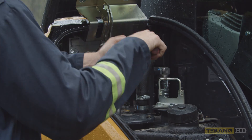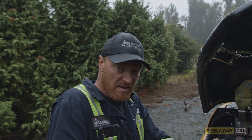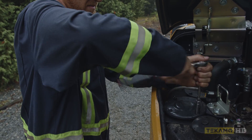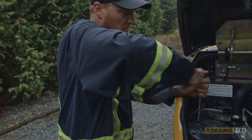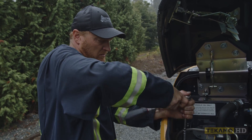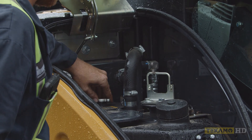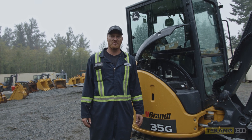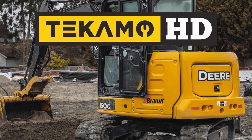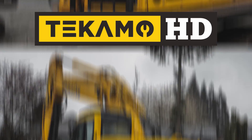When you're doing up these four bolts, I like to do the second one across from the first one — it brings the cap down evenly and makes sure you have a good seal. Make sure you put the hydraulic tank cap back on and make sure it's tight. And that is how you change the hydraulic oil return filter on a John Deere 35G.